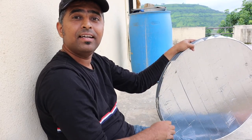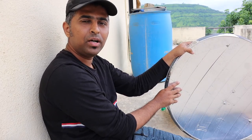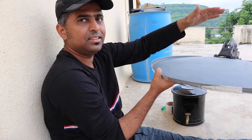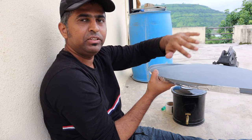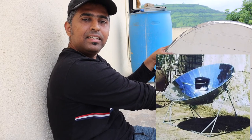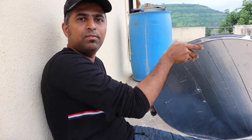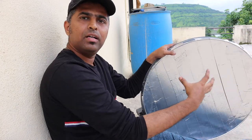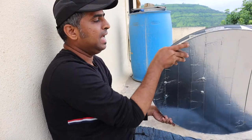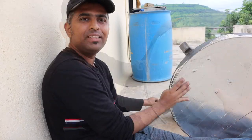In this case we will be concentrating the sun rays. In a commercially available solar cooker, the parabola has a big deep shape, and that is why you can find the focal point somewhere inside the dish itself. But since this satellite dish is a shallow parabola — originally meant for reflecting rays outside the dish — we will be having our focal point somewhere out in front of the dish.